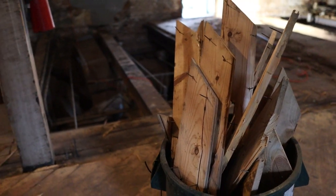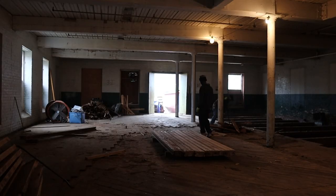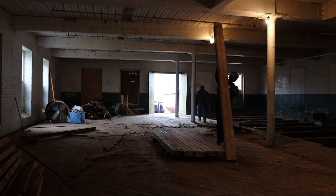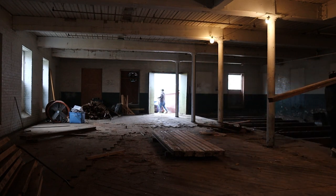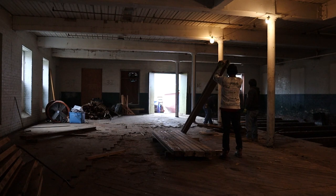That's a nice depiction of some trash wood there. The underlayment. The way this floor worked is you had 2x14s, 3-ply laminated together every other floor joist. Then you had a steel beam, a W12x35. So 12 inches tall, 35 pounds per foot, every other board. And they were supported 3 times across a 22-foot span.